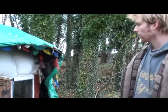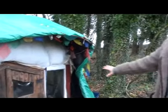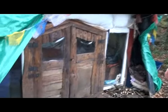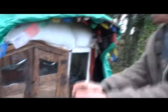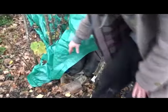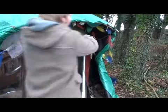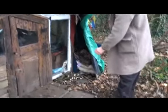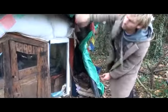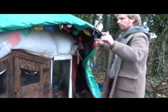You don't have to have a door, but I put the door in place so that I could build the frame around the door. Then you have to sledge in a metal bar, make a hole, stick your big coppiced bit of ash or hazel in, and then bend it over — maybe over your back — and someone gets it at the other side, brings it down, holds it there, and then you put another pole in and bend that over the other way. You can wind them round each other a bit, tie them on, and then you've got an arch.